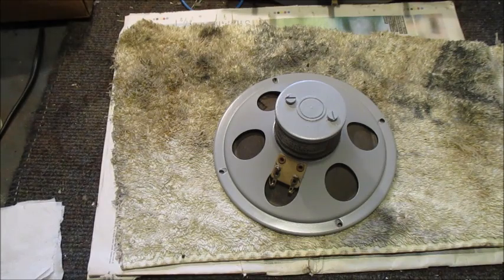I'm of the opinion that if you was to ask 10 vintage radio men how best to repair a damaged loudspeaker cone, there would be a strong possibility you would get 10 different methods. And there would equally be a strong possibility each method would work adequately. I usually use PVA glue for this type of repair work, but contact adhesive will work equally as good. Many years ago, I worked alongside a fellow service tech who would not use anything other than contact adhesive and what he referred to as closet paper. A closet here in my part of England is the bathroom or toilet.